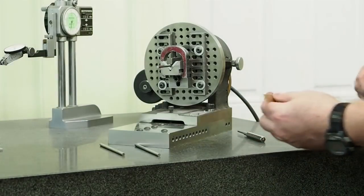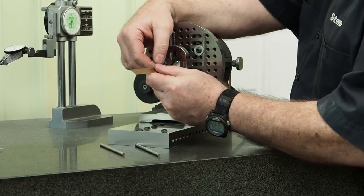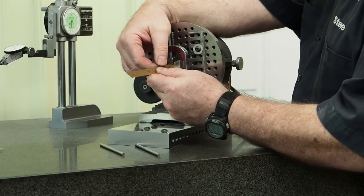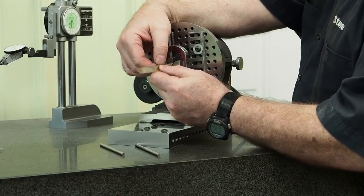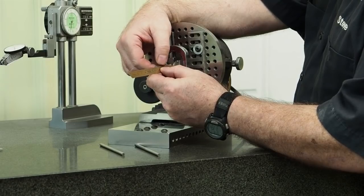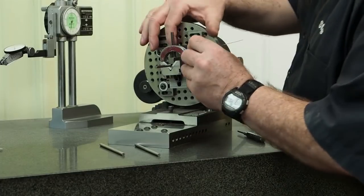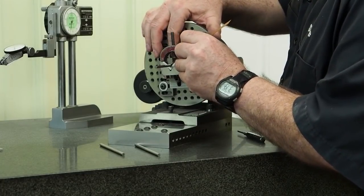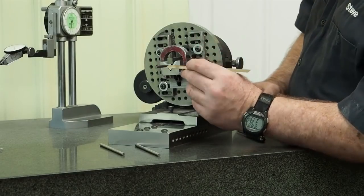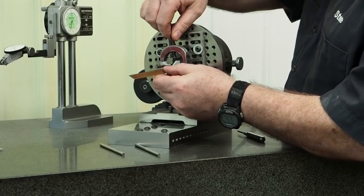I already know that I could get 1.8 with the old setup I had. So what I'm going to do is I'm going to pull this out a full 2 1/8 inches and see if I can grind about an eighth. Well, we'll go just a little over 2 inch, and we'll see if I can grind and get a full 2 inch cut with that wheel. And if that works good, coming down to 150, what I'll do with this pin, I'll just keep going as deep as I can and see how deep I can get before it starts singing on me.